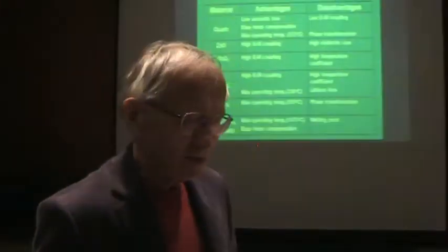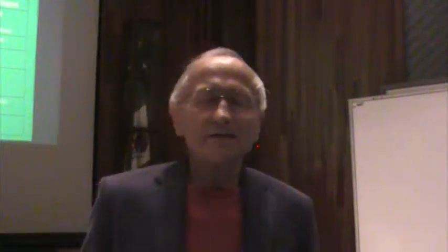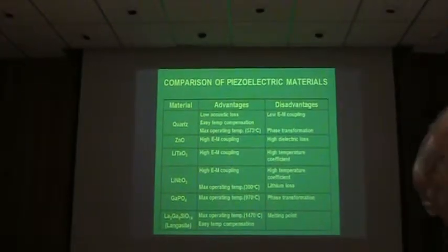So, yesterday we discussed surface acoustic wave technology. Two types of transducing platforms. The classic one, standard, with piezoelectric substrates and photolithographically patterned interdigital electrodes. The gas sensitive layer is deposited between transmitter and receiver, or, in the case of a low conductivity of the sensing layer, on the whole surface area. And the second type, with an intermediate layer.